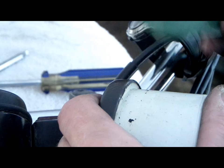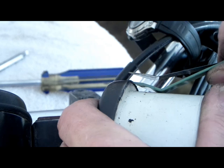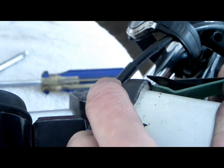There we go. I'm just pulling back on that ring a bit. Once you got a piece of metal like this, if you get a little bit bent up here, you don't go too far away because you're bending fresh metal. What you do is - we've got a bend here - so we'll move over like a millimeter or three in metric speak, and it's already bent to one side, so the other side is gonna bend a whole lot easier where you're at.